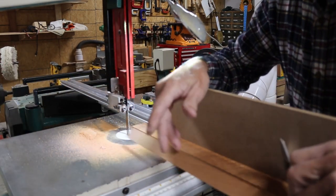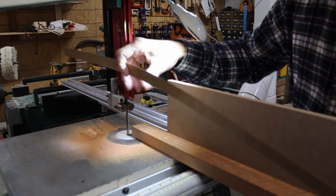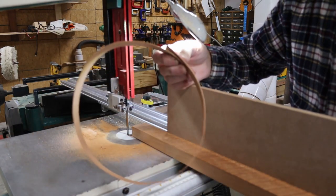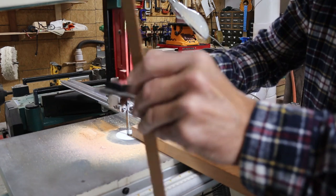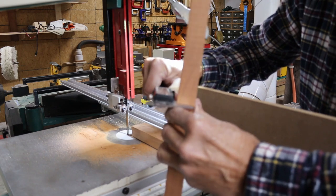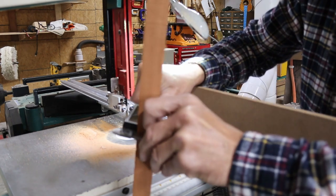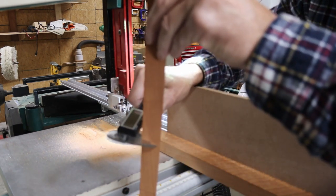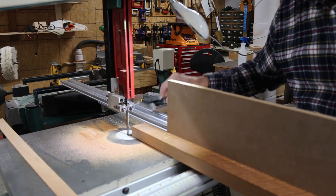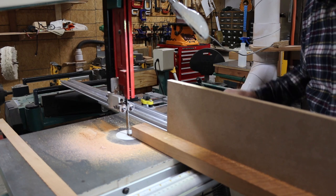That wasn't the best planned activity, but it turned out fairly nice. This is a really thin piece of cherry, and if you know anything about cherry, it's extremely brittle — yet look, I can bend it into a complete circle, that's how thin it is. It ranges in depth quite a bit: about 48 thousandths in one place, 35, 31 thousandths in others. So the next cut should be consistent. I need to remember to dial in 50 thousandths for the blade kerf first.